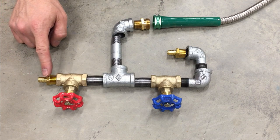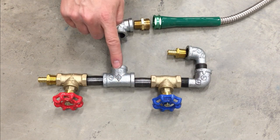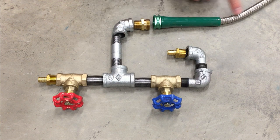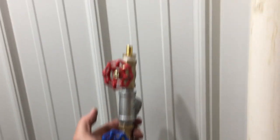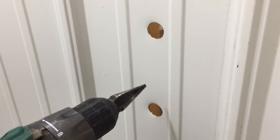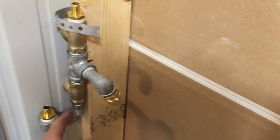I've got hot water coming in through this PEX connector to the valve to the T. Cold water coming in through here through the valve to the T. They mix in here and then go to this garden hose connector and off to the shower head. You wrap these several times with Teflon tape, screw them together and tighten with a wrench. All put together and we'll install it under our shower head. I drilled these with a hole saw, put our valve assembly through and put the handles back on. On the back side we'll just anchor this to the wall with metal strapping there and down here.